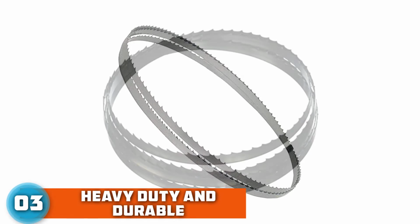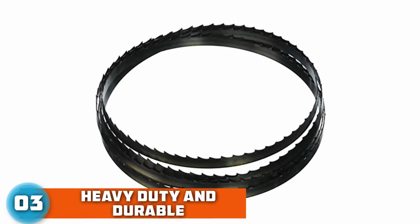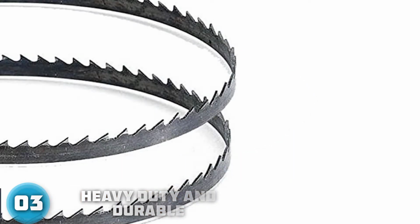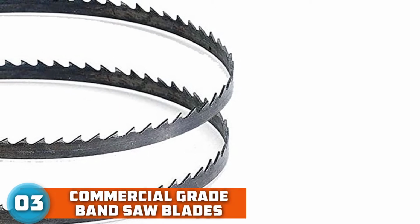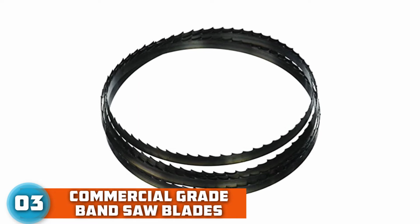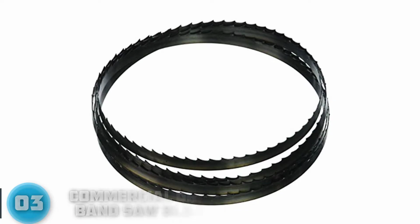Tooth hardness, 62-63 RC, back hardness, 28-32 RC. Regular, skip, and hook-shaped teeth, raker set: left, right, straight raker pattern. Cuts hard or soft wood, plastic, mild steel and non-ferrous metal. These are heavy-duty, durable, commercial-grade band saw blades for industrial woodworking, DIY and professional craftsmen.